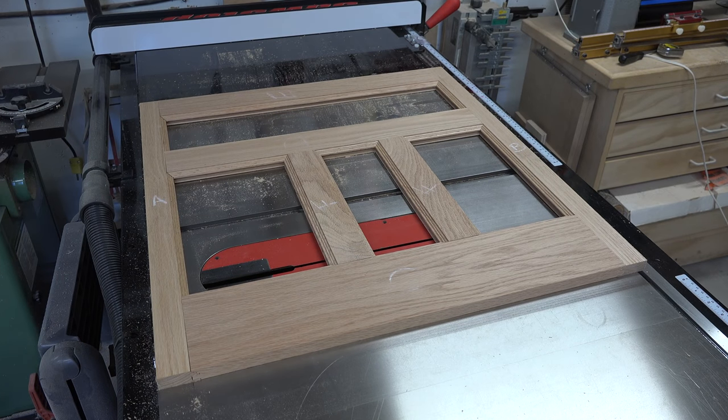As I've been doing all the coping cuts on the end grain of the pieces, I've been bringing them over to the table saw and assembling each panel — test-fitting as I said — to make sure nothing slipped out of place. I'm quite happy with all of the fits; everything looks fantastic. Route all your coping cuts, assemble all four panels, don't glue anything — just dry-fit for now — and sand off any burring gently so you don't lose the routed profile.